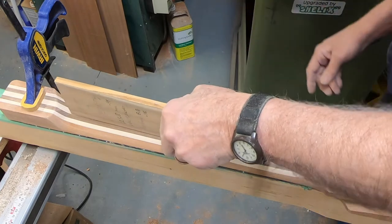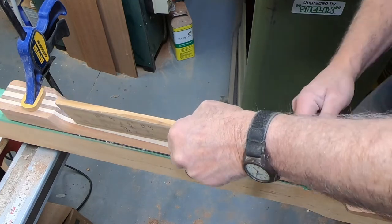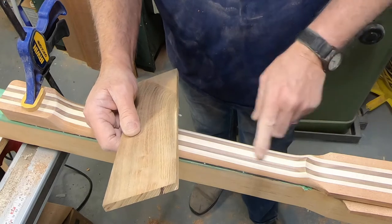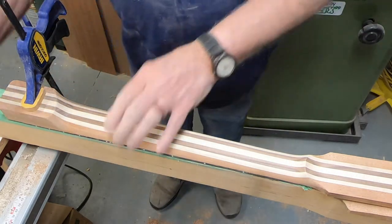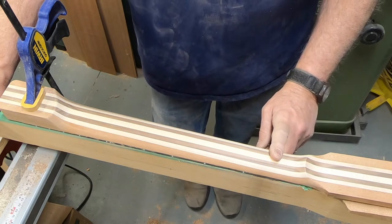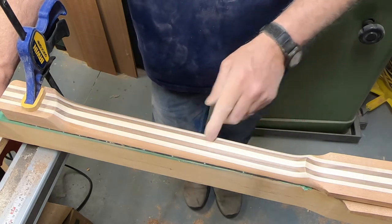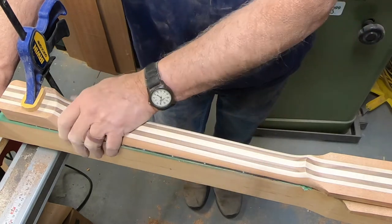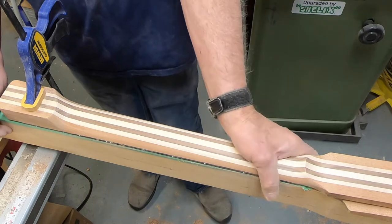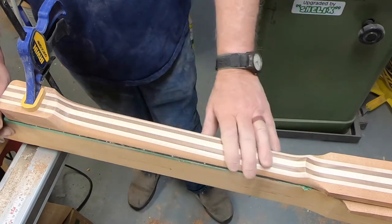I probably have the same thing on the nut end — yeah, as soon as I get to about here it wants to start running up. So I'll flatten this out a bit, make this a little steeper ramp here so you've got more consistent thickness. The measurement at the first fret is about 20.5 millimeters, and this is 24 back here at the 12th fret. It won't hurt my feelings if I get a little thinner. I did go back in and just bark the sides off both ways to give more of a V feel, although it's not real obvious. It's got a really nice feel to it right now — dimensionally the shape of the neck is a real great feel.